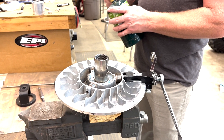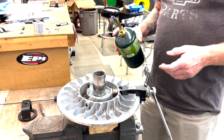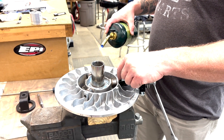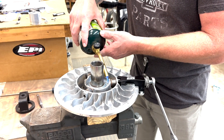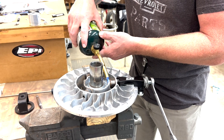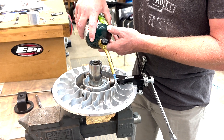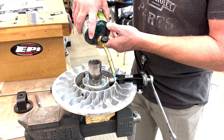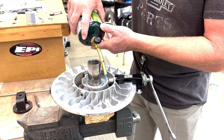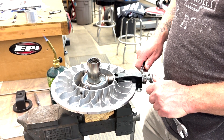At this point we're ready to pull the pin, but we're going to want to heat up the aluminum so that we can make the pin come out easier without trying to break things. The pin does press into the inner ring and the exterior ring, so go ahead and heat up just those areas as much as we can without heating up everything else, and now we're going to start pulling this pin.